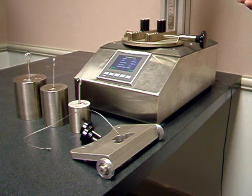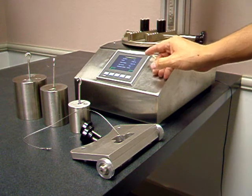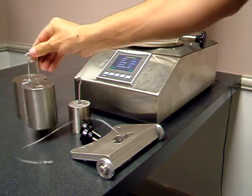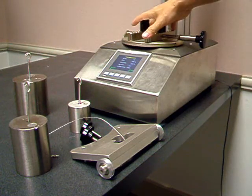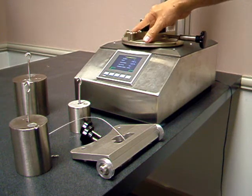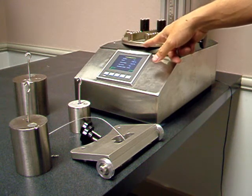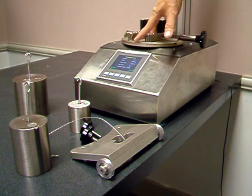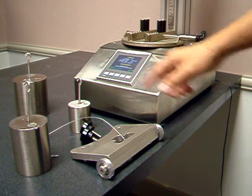For whatever reason you can change these numbers. But for this calibration I will pick the 5 pound weight, and will use the clamping assembly and the clamping platform as the pulley. There is a groove in the clamping platform, and the radius of this pulley is 3.3 inches. I've already entered the numbers accordingly, and I hit the next button.